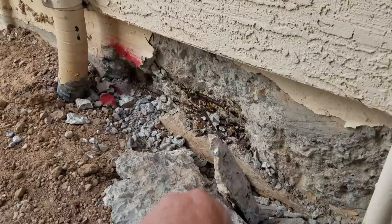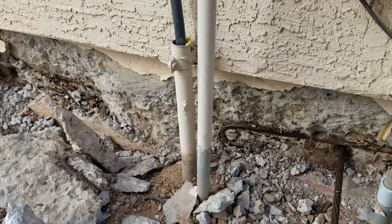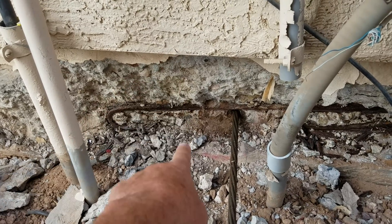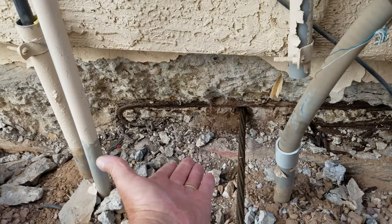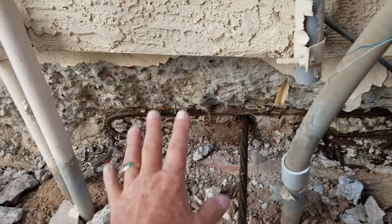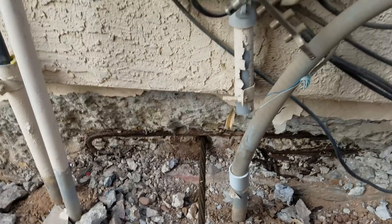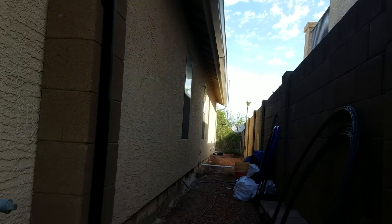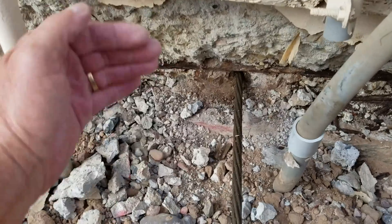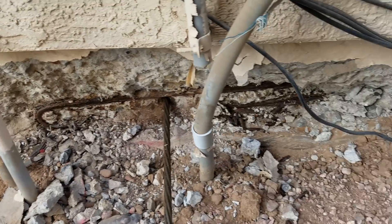Over here as well — this is what happens when you have a very shallow foundation. It's only 14 inches from the top interior floor to the bottom of the support footing or the soil. The dirt grading isn't quite high enough to shed moisture away. The homeowner did put rain gutters on, and they look quite nice — they're directed in the right manner. But this is all about moisture getting underneath and attacking the steel, exploding it, and breaking everything out on the outside.